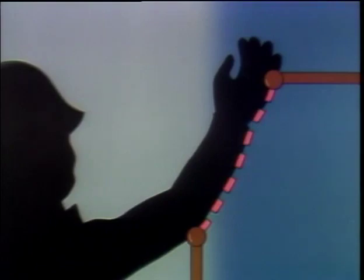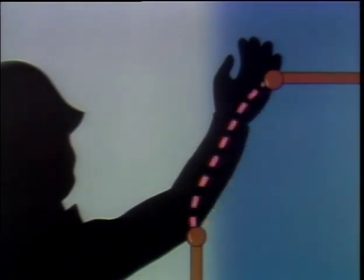The severity of the effects of current flow and its path through the body depend on the resistance encountered. The body's resistance to current flow is different in different areas of the body. For example, muscle tissue offers much less resistance to current flow than dry skin. So current is less likely to flow across the surface of the skin and more likely to flow through the muscle. This is why electrical burns are often so severe.